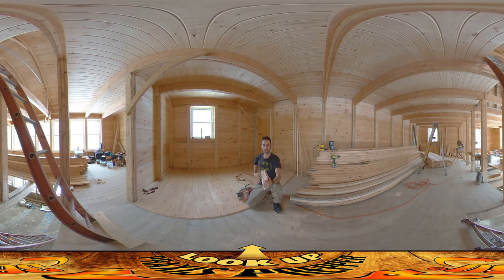When you're doing tongue and groove board work, the idea is that you take one board, put it above the other board, tap it down, and it drops into the other board and engages that way. Now if you need the boards to line up and the top one to drop in, obviously if you're going right up to a ceiling, the ceiling is going to prevent you from lifting the board high enough to drop it in — unless you cut the board lower and then you have a little gap at the top.